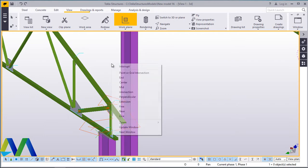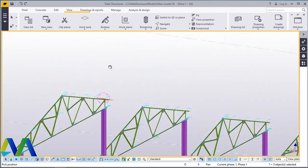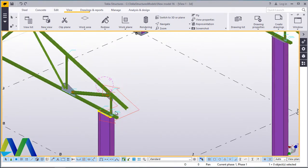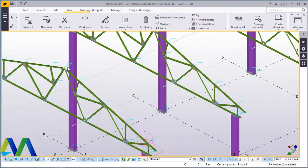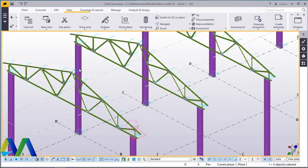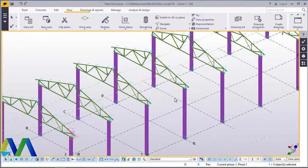Just click on that, right click and interrupt to disable that workplane tool command. Then come back to navigate, rotate with mouse, click that and rotate about that spot. You can turn this around like this. Now from here we want to lay our bracings, and to lay our bracings we have to create some markings on this chord and that chord. Now having done that, we just do a mirror, then we copy to the whole model truss.